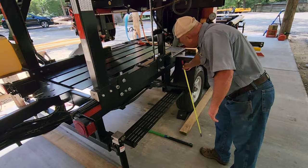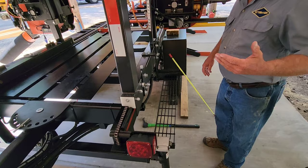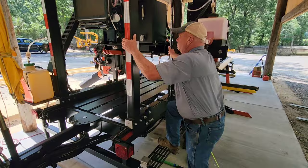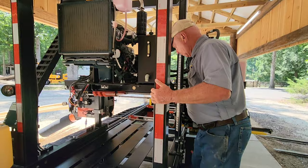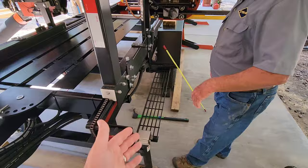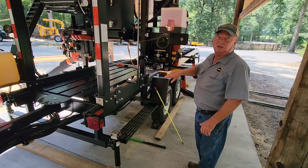Next, we're going to point out this heavy-duty fender, and in conjunction with that fender, there's a step that's been added — which is the smartest thing you could literally do. I've been working with construction equipment for about 40 years, and one standard that you don't vary is that if anybody's climbing on a machine, they have to have three points of contact for getting up and down. So now I can climb up on the machine, check the oil, get to the air cleaner, and do all that sort of good stuff — safely. There are also two handholds here — otherwise you're reaching the entire width of that large steel tube.